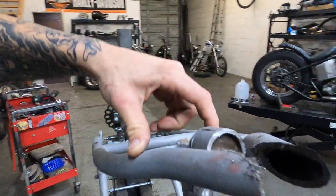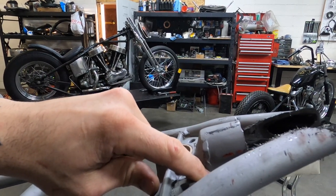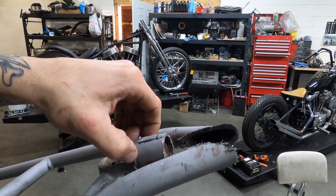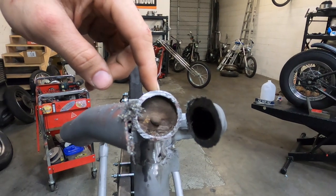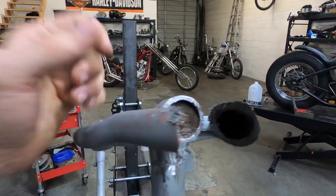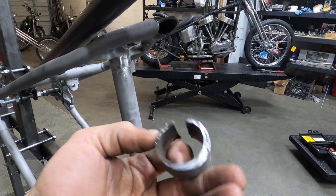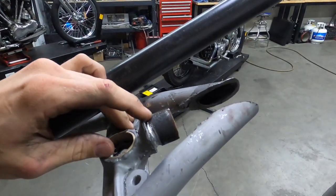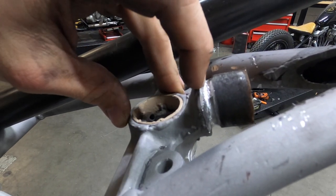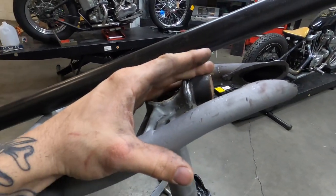There's a plug inside this and you can see it comes straight off the casting for the seat post here - they're always a nightmare to get off. You can see there's a full weld seam around it. So what I'm going to do is pull the material off. I could have just left it extended out and sleeved it, but I just want to run a whole new one - it makes me feel better about riding it. So I'm going to pull this off and check back in when it's off the bike. Okay, we got it off. Here's the piece that slipped over the backbone. This is all cast into the forge so it's super strong - I want to leave that there. You can see when I cut it I beveled down a little bit, so I'll clean this all up and come back in to do a filler pass to add the meat back on there. Then we'll be ready to start working with this.